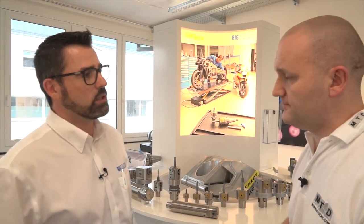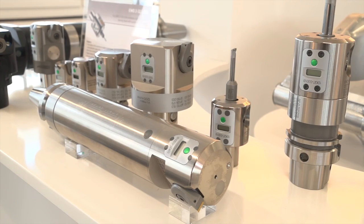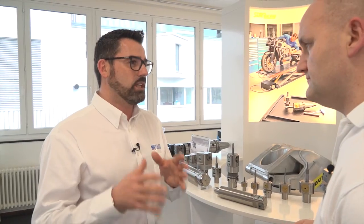With your carbide inserts as well? Absolutely — with our carbide inserts or with CBN inserts, we use our standard product. The digital boring solution and the analog boring solution go together, so we are not phasing out anything on this program. The digital boring tools are totally compatible with analog. If the customer has their own shank, their own modular system from Big Kaiser, they can simply change the boring head and they have a new era of tools.